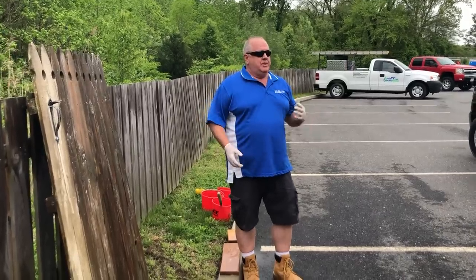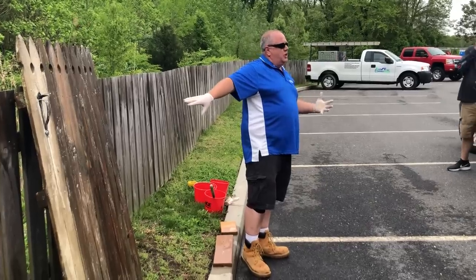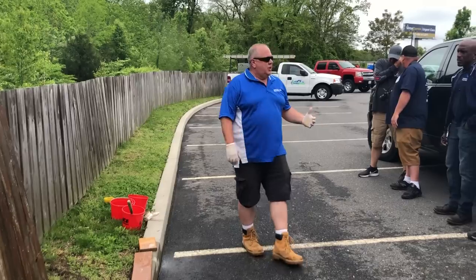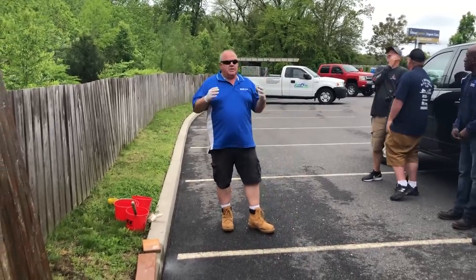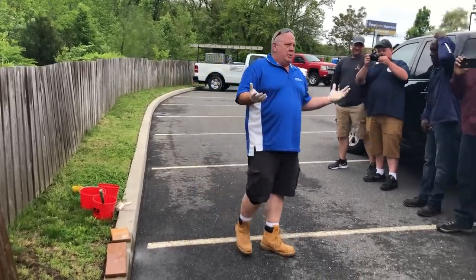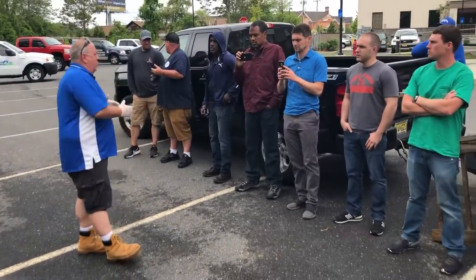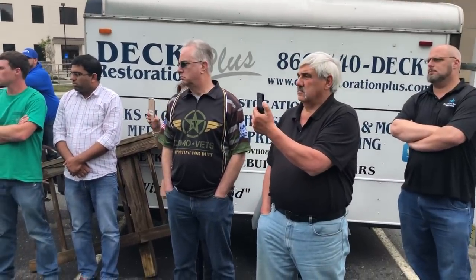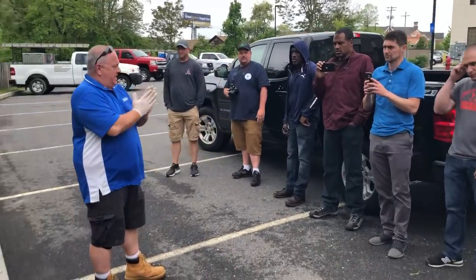Dwell for about 10 minutes on cleaning, even with the strippers. The strippers that you're using, when I say strippers, the sodium hydroxide or sodium metasilicate, even using those, more than 10 minutes is probably too much on a wood surface. The way I describe it to a homeowner is, most people have self-cleaning ovens now, but if you use the oven cleaner, it's the same way. You put it on, it works off the surface, 20 minutes on, wipe out. Otherwise you're scrubbing half a day, right? So it's the same principle.